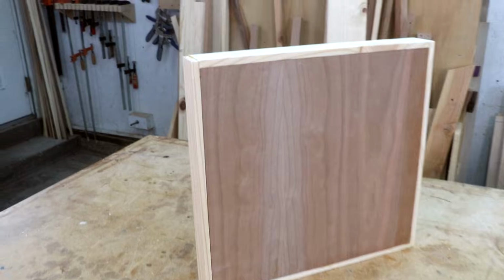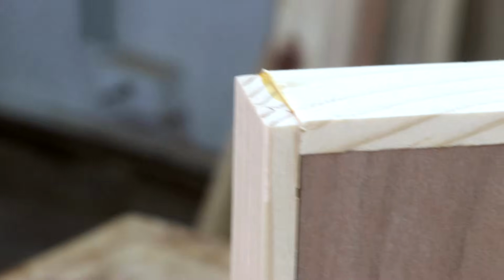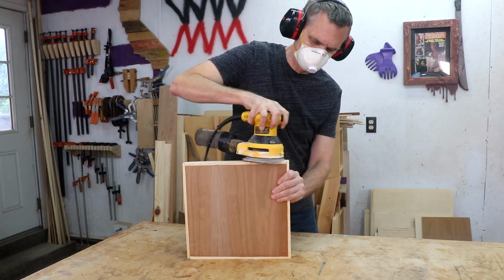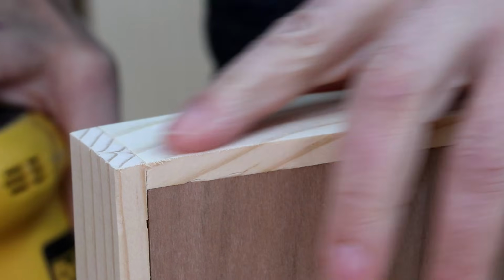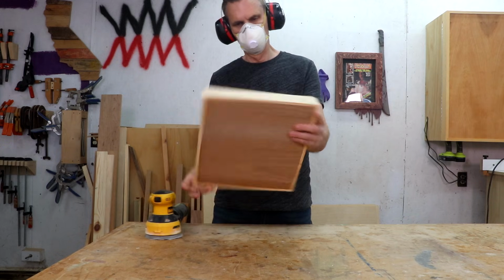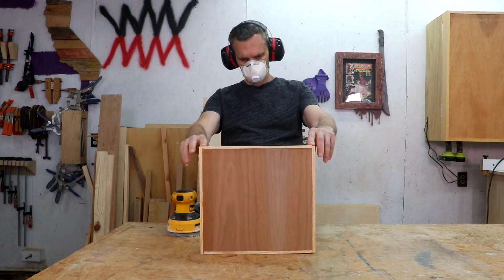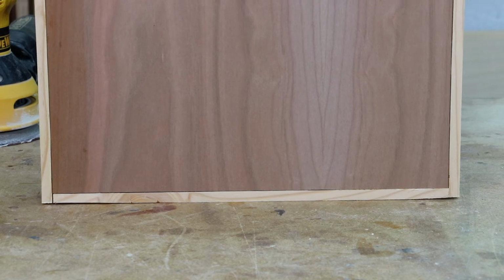In the real world, woodworking joints aren't always as perfect as they are on every Instagram post ever. So let's say you've joined 2 boards together that aren't exactly flush. Hey, it's just a little off, and a couple of minutes of 60 grit sandpaper will smooth it right out. You fire up your sander and attack. Yay, both sides are flush. But now you have a cupped board because you neglected the middle. And if this was the bottom of a box or something, now you've got a rocker.